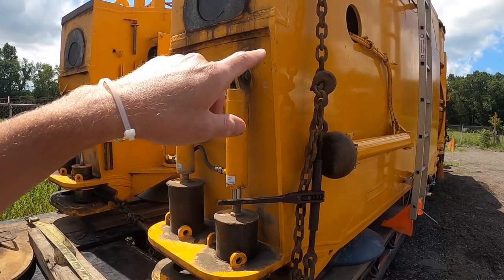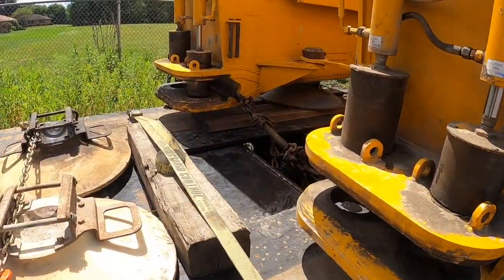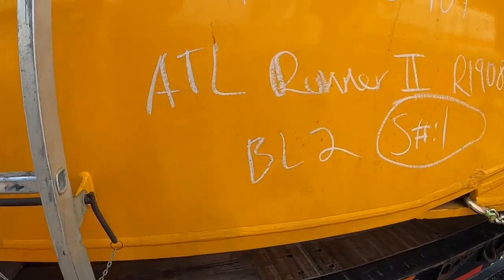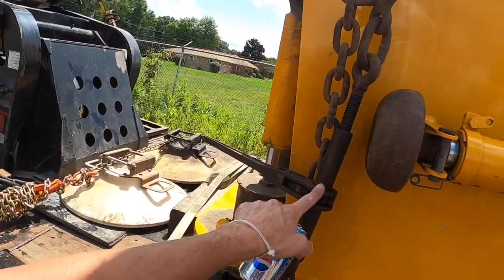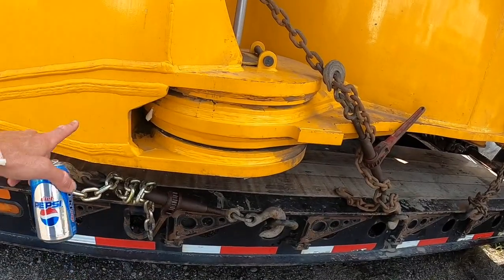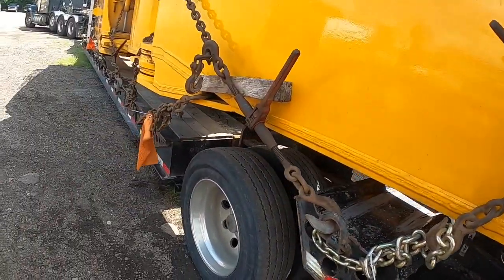So what we did here: one chain on each side, always - so one pair to the top, and I had to use my latches. Then two chains in there - one chain like this, one chain like this - then one chain in the middle. By one chain I mean two short chains, so one pair. That's 20,000 pounds. This pair holds 20,000 pounds, this one holds 20,000 - that's 40. Then 60, this pair is 80, this pair on the same one on the other side is 100, this is 120, 140, 160, 180.